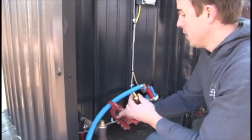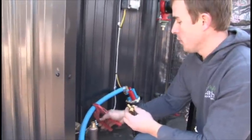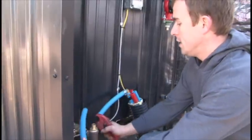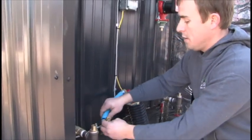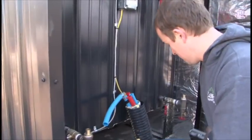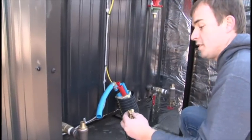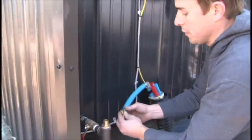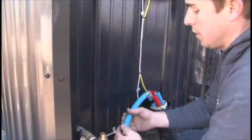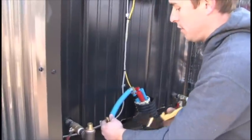I am going to install a one inch to half inch tee in my return line. The reason for this is I will tie the half inch side into my water supply from the house to use this as a bleeder for the system upon installing, or anytime you're starting up the unit.